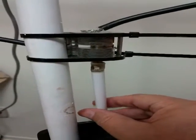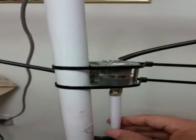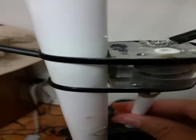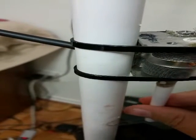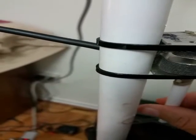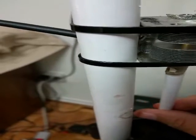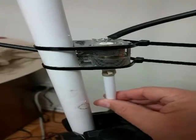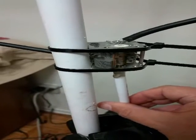Now you can see the plates on this are really close together. At the top we have the other loop — the primary. This is basically a transformer. That little loop at the top is what drives the outer loop, and the outer loop is tuned with this condenser.